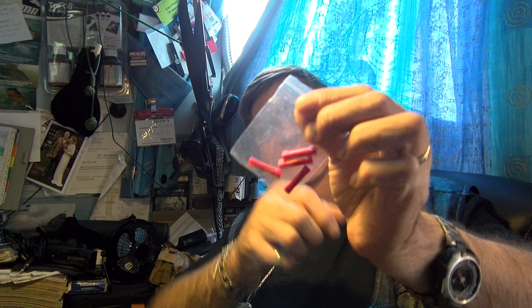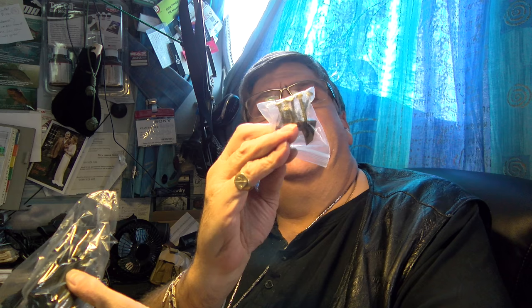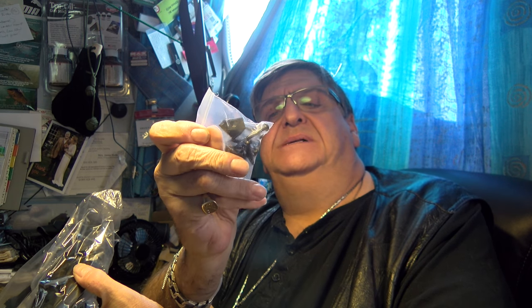That's a decent connector — as I've said before, a good crimp causes a micro-weld at the point of mega-squeezing, which is actually better than a bit of solder. Here we have the little pack of parts as well, because you always get basically some clips and screws for mounting the thing in the ironmongery, if that's all you have. I've got a couple of lovely MBF enclosures.